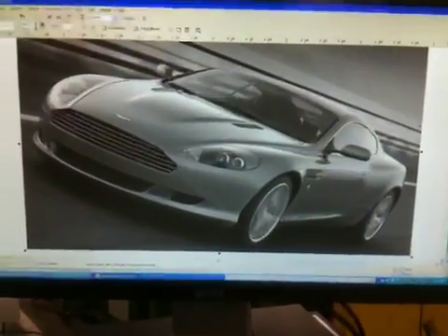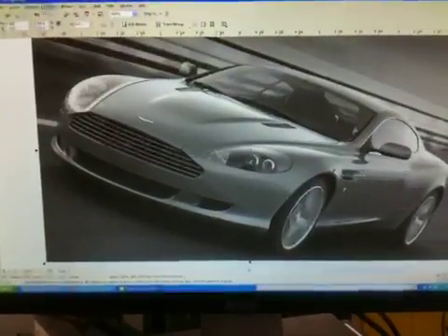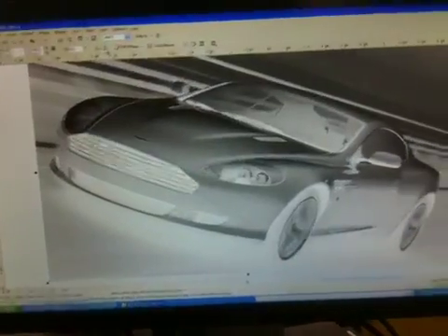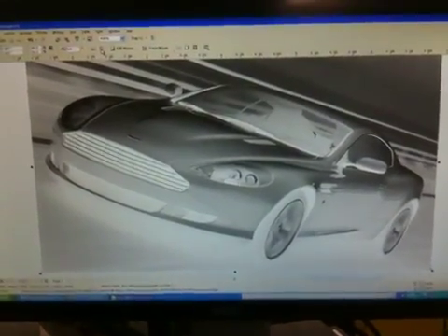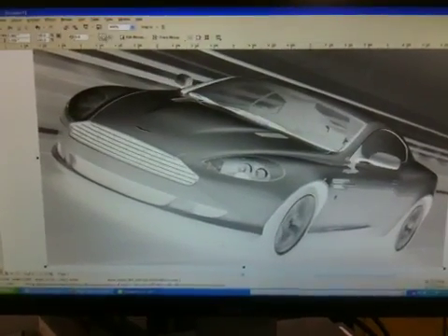That's the picture. To make this work, you take the picture and invert it — that's exactly what the laser sees. When you're printing on anodized aluminum and you have a picture, you have to invert everything and convert it to a bitmap.